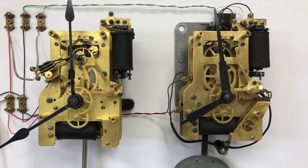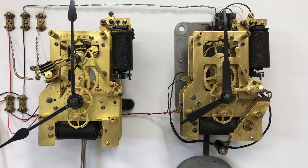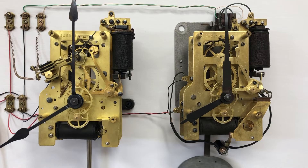So we've seen the changes needed so the clock can be synchronized. Now watch the synchronization in action. Two seconds before the hour, the master sends a synchronizing pulse to the subsidiary clock. The pulse activated the coils that move the lever arm that precisely pointed the minute hand to the hour. So simple but brilliant.